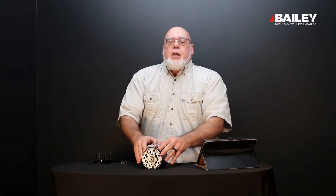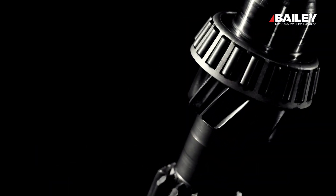You can ask yourself: can I use a gear pump as a motor? And the answer is yes, you absolutely can. But is that the right tool for the job? Gear pumps are meant to pull oil and push oil out the other side. Motors are meant to take oil in and transfer that to the shaft and output torque — two totally different functions. A gear pump can be used as a motor, but it's not the most efficient use, especially if you want to plumb motors in series. These motors can handle pressure on both sides; a gear pump can't — it can only handle pressure on one side. These motors are also bi-rotational: you can spin the shaft clockwise or counterclockwise.